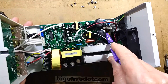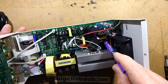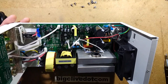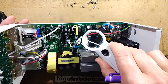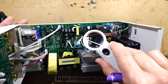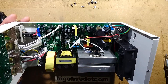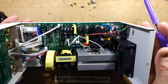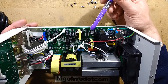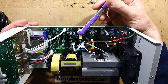We've got a little yellow X2 suppression capacitor, then a fairly chunky bridge rectifier, and two 250-volt capacitors which are most likely in series - and I can see some resistors down there which are probably 100k balancing resistors. Then interestingly there's another complete power supply section - a bridge rectifier, a capacitor, and a DK112, which is an interesting little switch mode chip associated with this transformer here.